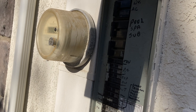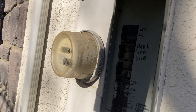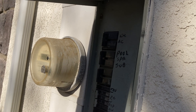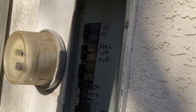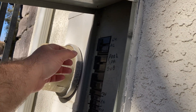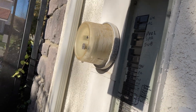We had a friend of the family who was a journeyman electrician and he ended up passing away because of an arc flash. It's not an electrocution — it's basically an explosion. It burned his lungs and he ended up dying from the infection. I also know another person who was standing off from a panel during an arc flash and it badly burned their hands.